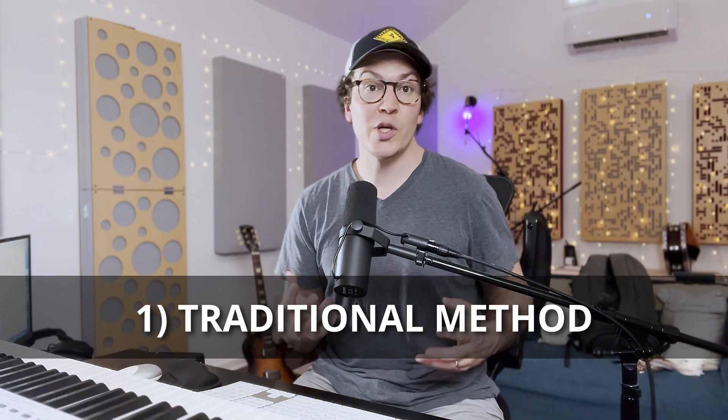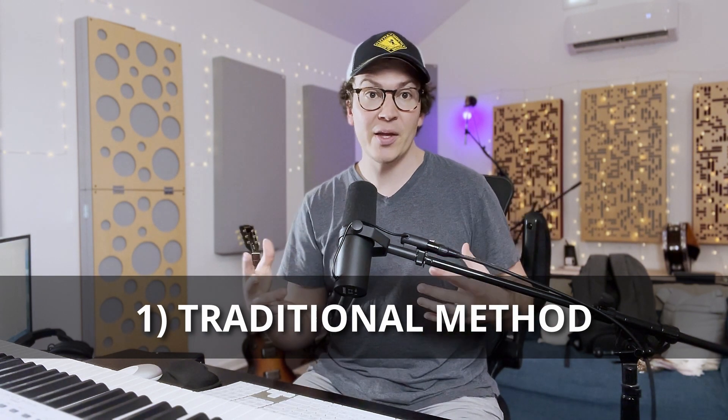The first method is the traditional method. This is what I did in my studio, and it is also what I really wouldn't recommend for a soundproof studio. The reason being that you allow too much air to come into your attic space, thus decreasing the amount of transmission loss you're trying to get. If you're talking with a builder, there's a chance they are probably going to use this method because it is the most popular method when designing cathedral ceilings.